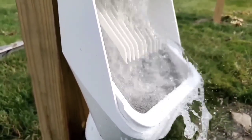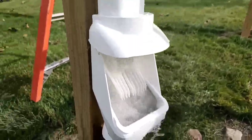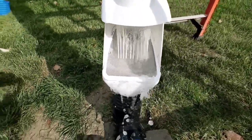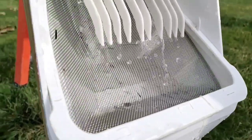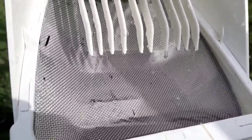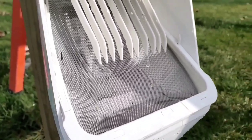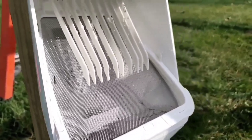It does have a pretty good hood to prevent the water from splashing up and towards the back. But here's the reality of it during a really hard rain event. We're filling a gutter trough and letting it fall one story gravity down a downspout so we can see how everything performs. You can see the really tight knitted screen — you're going to have to clean that regularly. It gets plugged up pretty fast in the real world. So that was it working at its best.